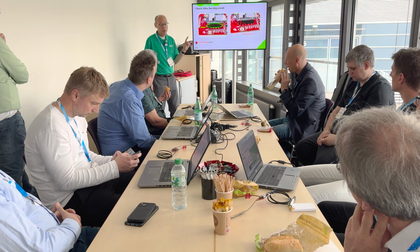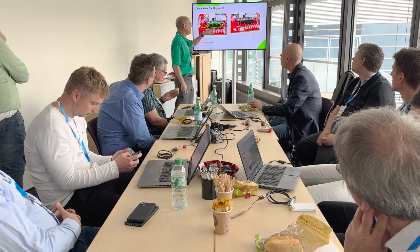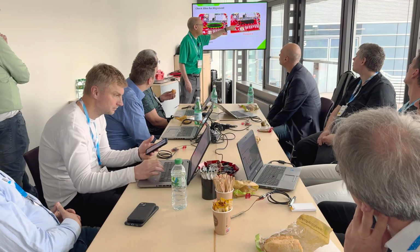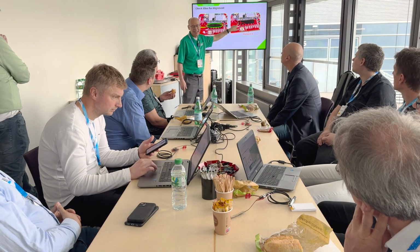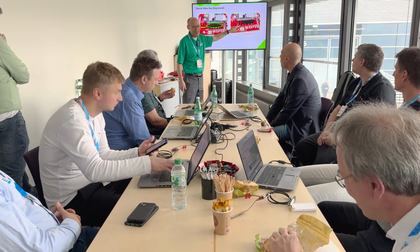One other thing I like to point out: we've already put your XBees in the board, but when you insert it, there's a 20-pin connector, 10 pins on each side, and it is very easy to be 1 pin off and have one sticking out there. You will make this mistake. We all have made this mistake with XBees.